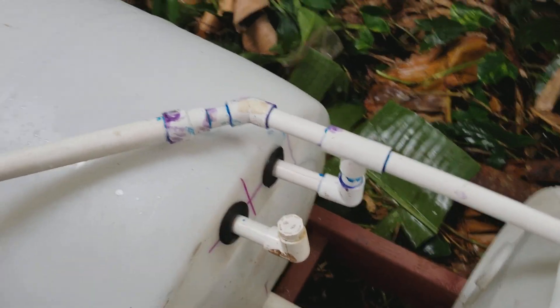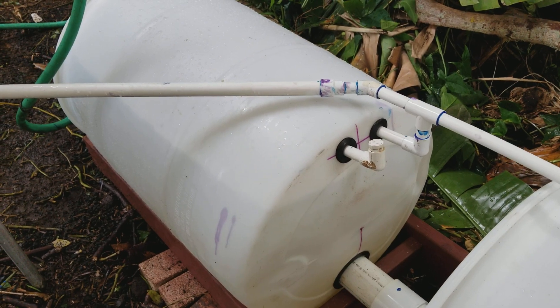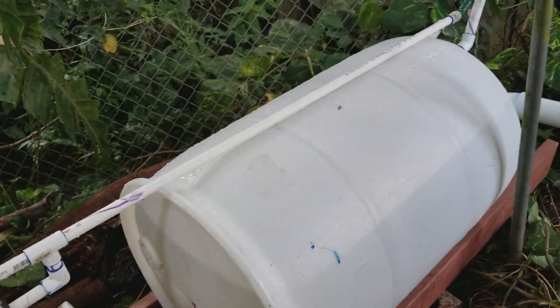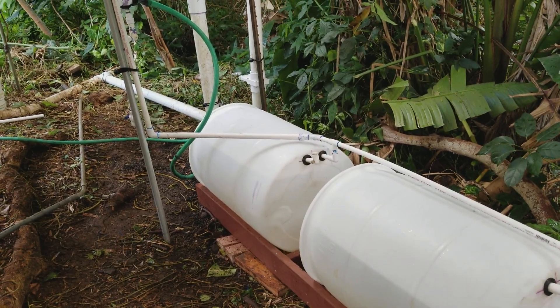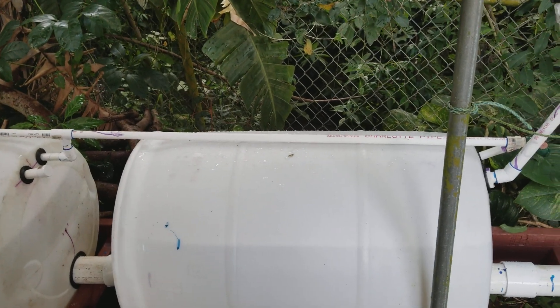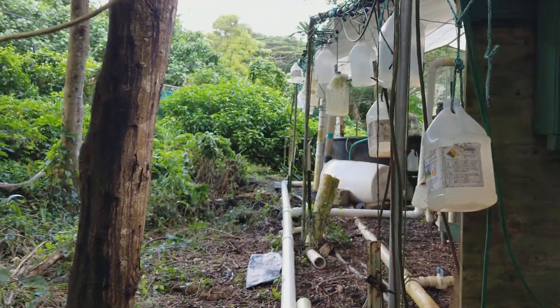We have this one, we can use it as an alternative. We could have a flow control in there as to how high or how low the water's going to go in that tank. Right now we're going to pressurize these guys up and the water leaves these drums. By the third drum, notice that all of them have air. We tried running on one drum, we got two psi; two drums, now three drums. So you see the air was being carried all the way through, nine feet here, all the way to here, and now it's heading up the hill and going to the fish tanks.